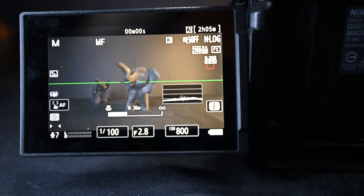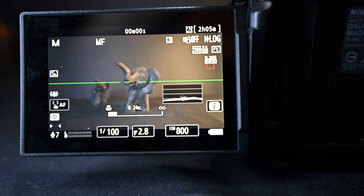If you don't have a monitor or a larger screen and you're looking just through the back LCD, which is a fairly small screen, sometimes you might not be able to catch the correct focus with your eyes alone. That's where focus peaking comes in — having this outline that tells you which areas are in focus can be very critical if you want to nail perfect shot focus.